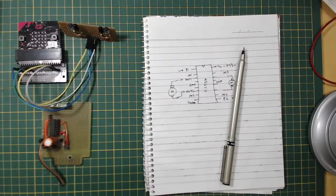Welcome to part 2 of this series on building a line follower robot with the BBC micro:bit. In the last video I demonstrated how to read sensors. In this video I'll be covering motor control using an L293D motor driver chip, and using a simple algorithm in Touch Develop to make a wheeled robot that can navigate a line painted on chart paper.